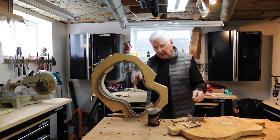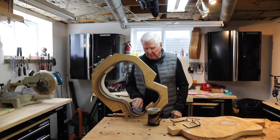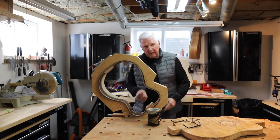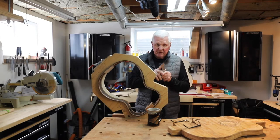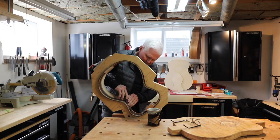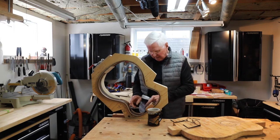What I do is I take a heat gun. When this thing is sitting in here like this, I just gently heat the wood. I don't want to melt the glue in here, I want to melt the glue here. So I just heat a little bit of there, but I heat the end of this and get this very warm. Then what happens is I start to very gently pry this in between the wood and this, going into the glue.